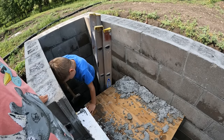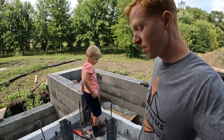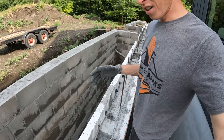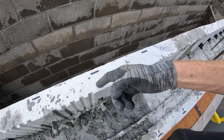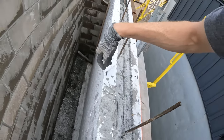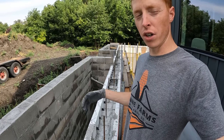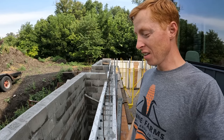Welcome back to the channel. It is day two after the pour of the ICF wall and block wall. I've got some helpers around — these guys are going to help me clean up all this stuff so we can waterproof the wall. ICF walls are not good for water barrier — there are foam channel supports, tie bars, all kinds of gaps with the blocks put together — so you really want to waterproof this thing really good. We'll prep the surface, prep the footing, and do it in this episode — episode 14 of this patio project, otherwise known as the bunker.